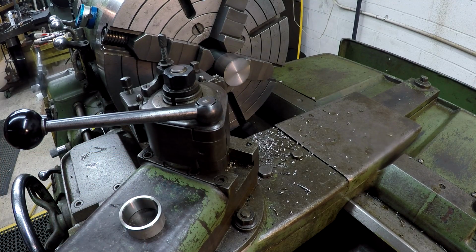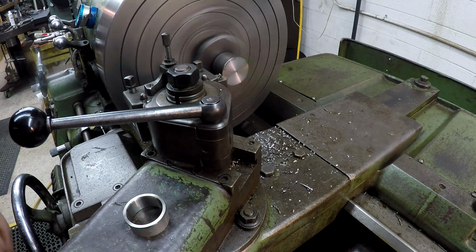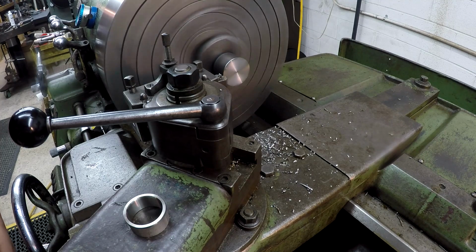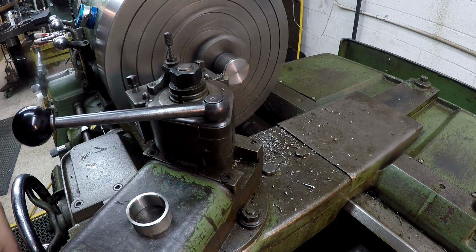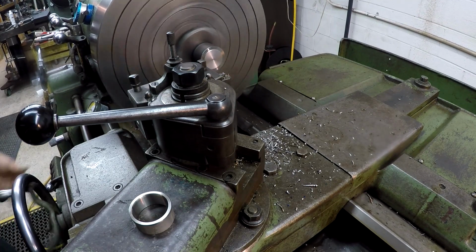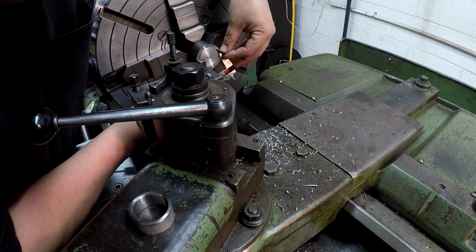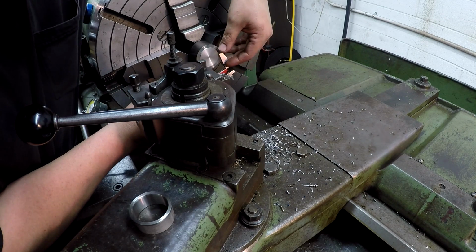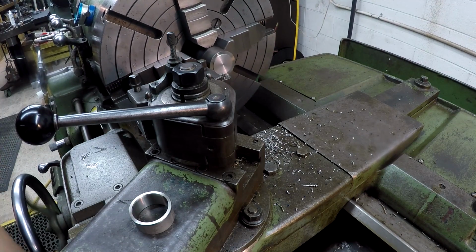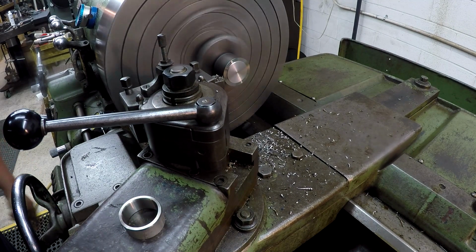Okay. So well, we got a little over 1/2 inch to come down. Zero out this cross slide. Alright, so I just went in 1/2 inch. 1 inch 507. So I'll go ahead and get the rest of it turned down close to that, and then I'll finish it to size. Come into my 0.